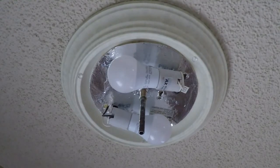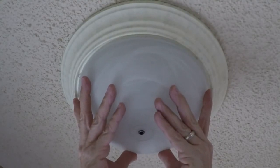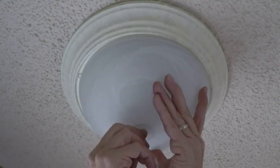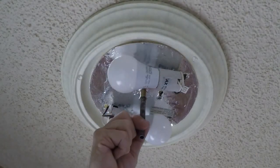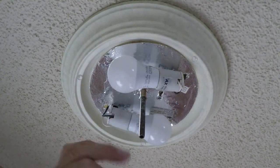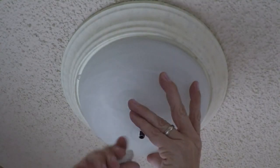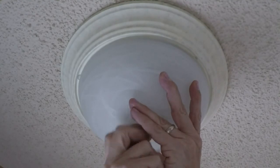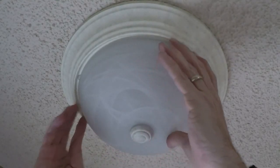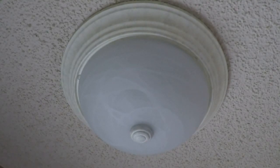Now it's a matter of repositioning the globe in place on its little pedestals. You notice there's a little bit hanging down — not enough — so I'll drop it and extend down about another eighth of an inch. I've had to do this probably three or four times to get the right distance so I can get the cap and globe on. Put the globe back on very gently, then the cap — snug it up, make sure you're centered, and that's it. Now you've got a gap all the way around the top, you'll hopefully get a good exchange of air in there and make those bulbs last longer. Hope this helps, thanks for watching.